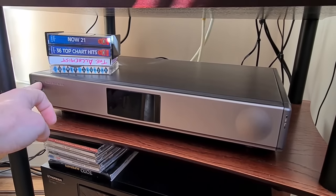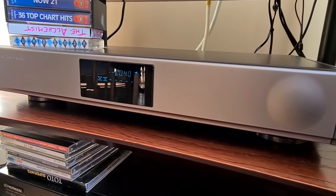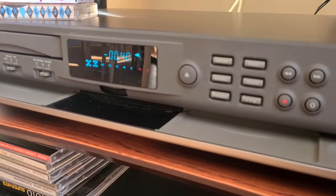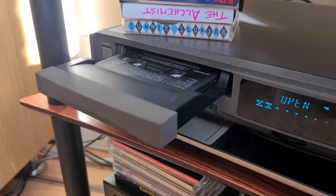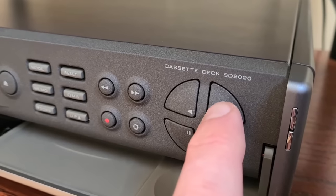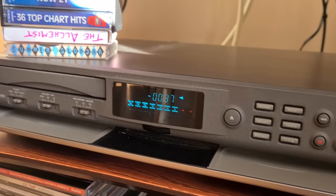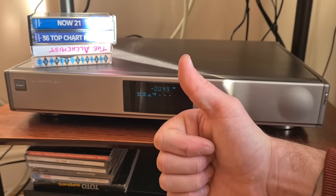I've really enjoyed working on this deck - it's fairly new compared to what I'm used to working on, and that kind of shows in the way it's put together. Being a drawer-fed deck means it's been fairly easy to get the transport in and out, no real hassle - just the same as a CD drive. It looks amazing and its looks were the main reason I was even interested in buying it in the first place. It's been a fairly simple repair - we've replaced the belts that needed replacing, done our adjustments, and now it's sounding pretty good. I've had it in the rack most of today playing tapes, and with the azimuth correct it's sounding exactly as it should have done when it was brand new. If you like my cassette content, maybe consider subscribing.